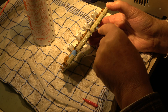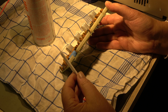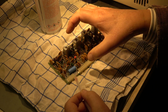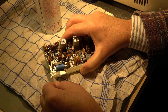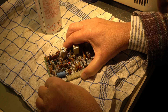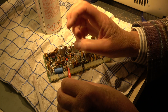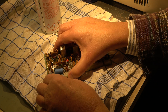These contacts should be checked after some decades to see whether they are okay. The cleaning is rather simple — I take a pipe cleaner and add some drops of contact cleaner to it. Use a contact cleaner of your choice, then simply put it into the contact. It's rather easy to clean. There's also an option: an interdental brush or floss heads can also be used, they have a diameter of two or three millimeters. But I use a pipe cleaner — I think it's a little bit better for this purpose.